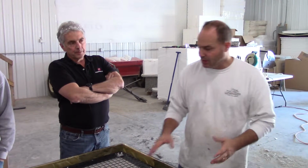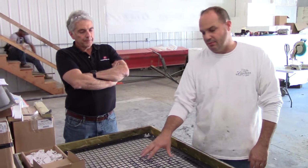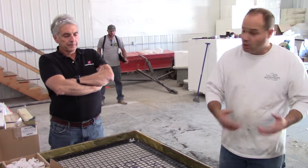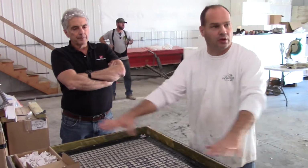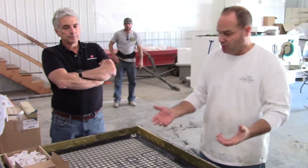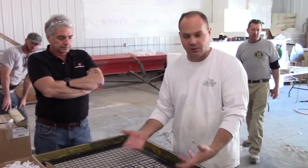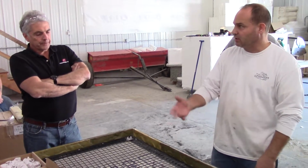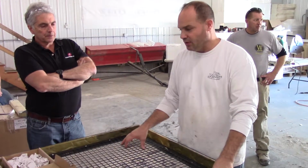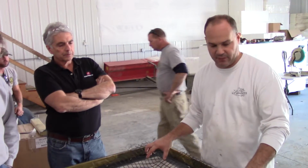It doesn't matter if it was 3 inches or, in this case, less than 1.5 inches, because metal in an alkaline environment rusts 4 times faster. We don't want anything in our artwork to destroy it or corrupt it. And the last thing we want is that corrosion effect inside of our concrete creating problems for us, whether it's 4 years down the line, 5 years, 7 years down the line. So for the money, it's the GeoGrid fiberglass mesh